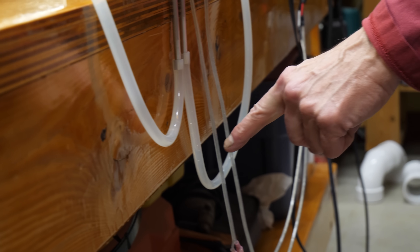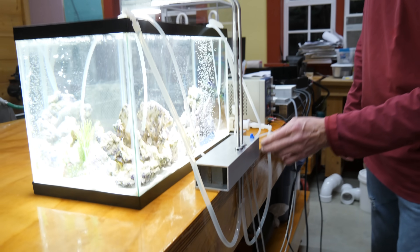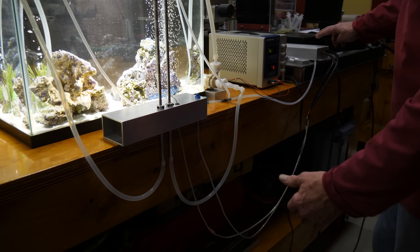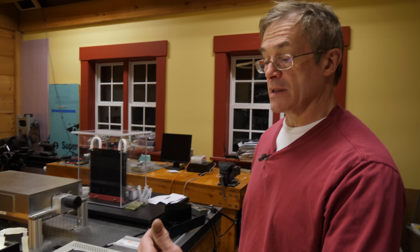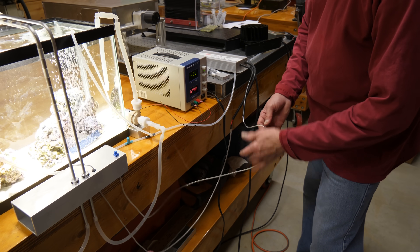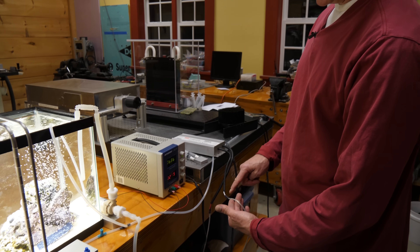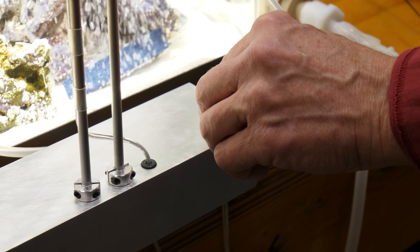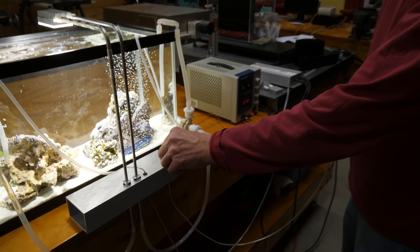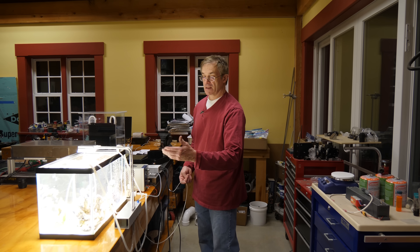To the ends of the two tubes we've connected two silicone tubes to guide the water in and out. There is a line coming out that provides power from the Meanwell LED dimmable driver that can provide up to 90 volts, which can drive the two 35-volt LEDs in series. There is a second line that runs over to the dimming function — you can dim either with pulse width modulation, with a 0 to 10 volt external power supply, or by varying the resistance through a variable resistor or pot from 0 to 100k, allowing you to adjust the light all the way from off up to one half the intensity of sunlight at the equator at noon — more than 20% more light than a 400-watt metal halide from this tiny little head. Obviously overkill for this small tank, but you can see the potential of this kind of lighting system.